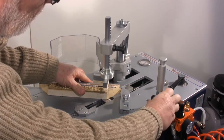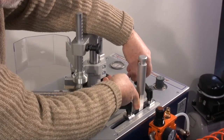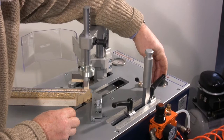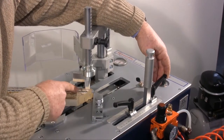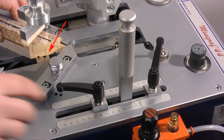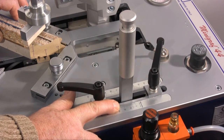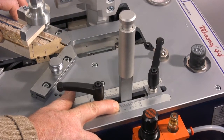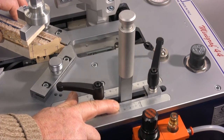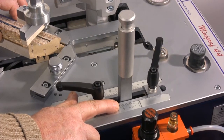We have to tighten the special lever to fix the position. We then fix the position of the last wedge, the one towards the outer part of the corner. It's not possible to fix the position of the middle wedge. However you can facilitate locating the point by using a mm scale which is found along the track of the trolley. We can note that the position of the middle wedge is of 20mm. When we make the middle wedge come out we'll have to put the trolley on 20mm.